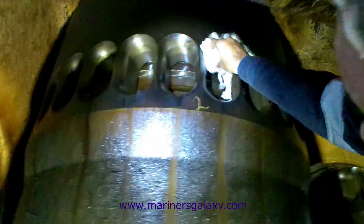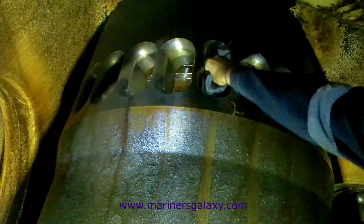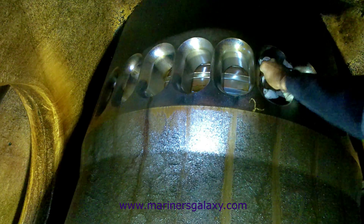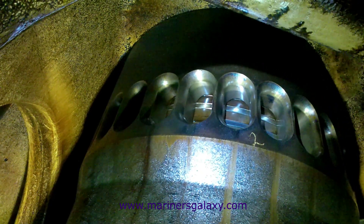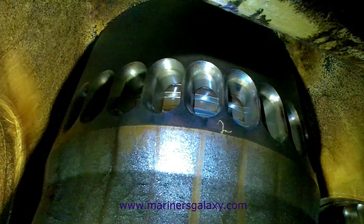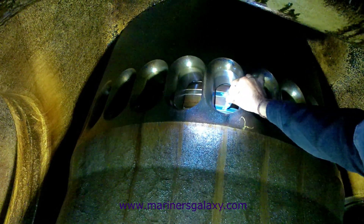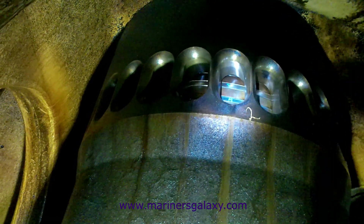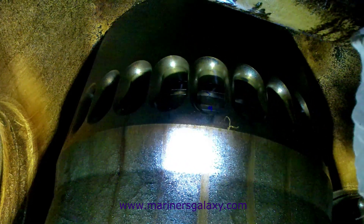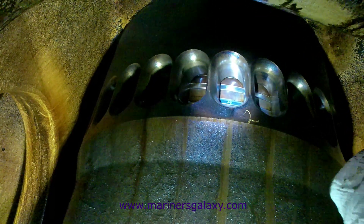Now you can clean and mark them — three and four — as this is a four-piston-ring-pack unit, so you mark them three and four because they are the bottom two. You can go around and check all directions of these piston rings. It is better if you have two people doing this scavenge space inspection, as you can easily check all sides since the space is restricted.